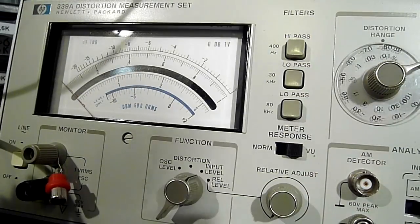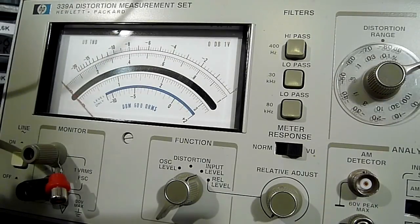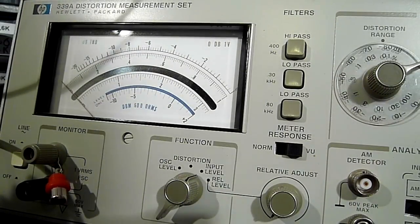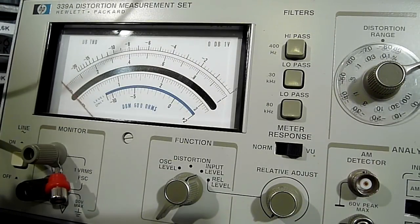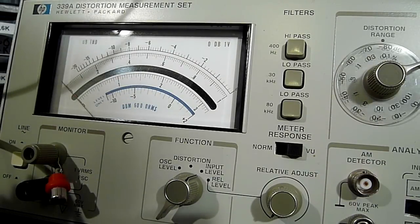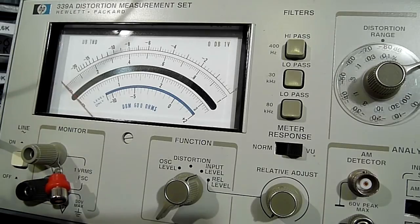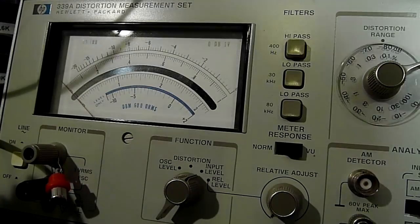Turned it off now. And for an amplifier that's rated for 240 watts per channel into 8 ohms at below 0.01% distortion, I think 265 watts into 8 ohms at 0.005% or so distortion is rather respectable. I am very happy with this.